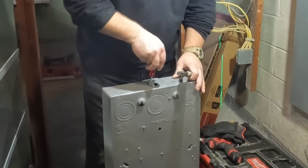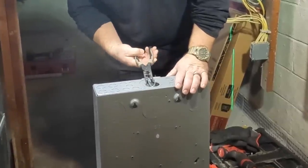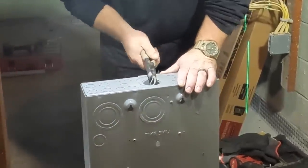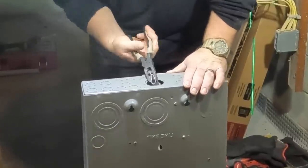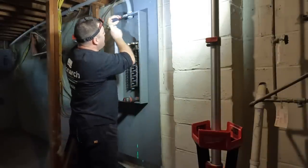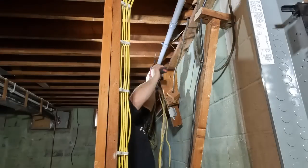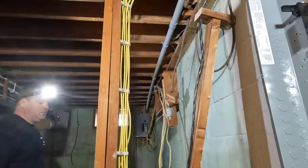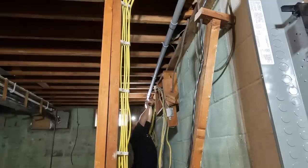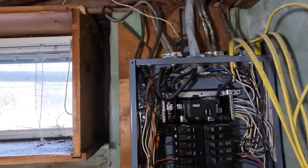Be real careful when you're taking this knockout out so you don't remove too much. I've been using these Square D panels more often lately and I feel like these knockouts are easier to take out than they were in the Cutler Hammer panels. I'm using an inch-and-a-quarter PVC conduit here, so I'm taking out an inch-and-a-quarter fitting and tightening up the lock nut. I wasn't exactly pleased with how the conduit was sitting, so I cut out that stud closest to the wall. That black wire going through there — I couldn't disconnect it until the following day because it fed another sub panel.